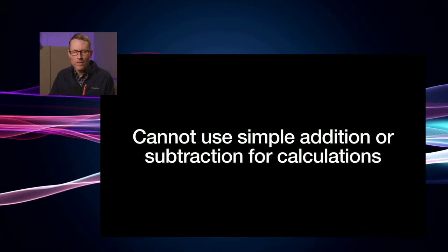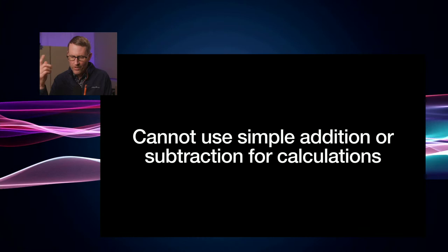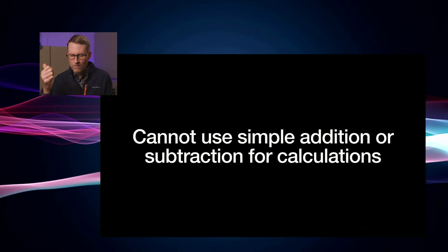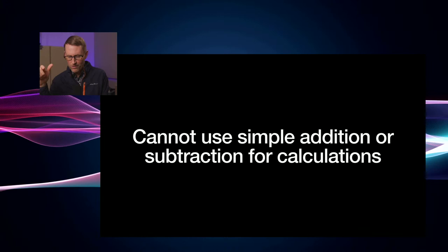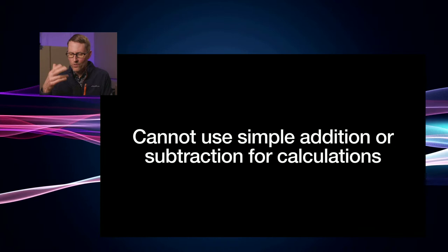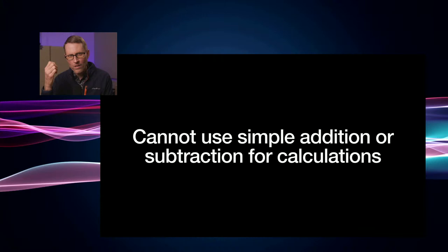If you were to go to a venue where we had a loudspeaker set up and we were putting some music through it, or maybe even just a tone, and you took your dB/SPL meter up to it, and you're standing, say, a meter away, and you took a measurement and it read 90 dB/SPL. First of all, you should be wearing ear protection if it's that loud and you're that close to it. But secondly, if I took another speaker and put the exact same signal through it, the same power, and now both of those speakers are right next to each other, they're both putting out that same amount. If I take a measurement with the dB/SPL meter, what do you think it will say?